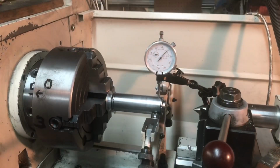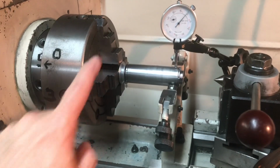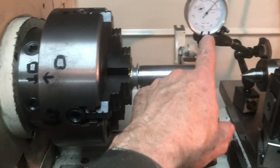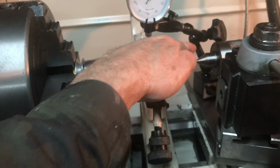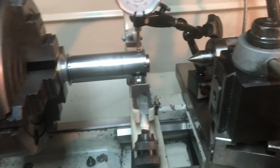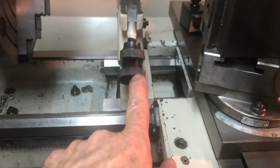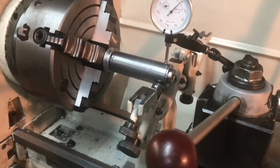Okay, so I wish I would have started out this way. It's taken me a whopping 15 minutes. I put the 4-jaw chuck on, tightened it all up, got the brass nut centered in the hex nut centered in the 4 jaws. I just used my indicator for that. I had the end of this supported in the rotating tailstock, so it was pretty close, within a few thou actually. And then I just ran this thing through, and I did have to make some fine adjustments with these controls on the steady rest, but it's worked out fine.